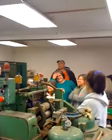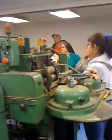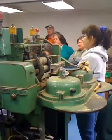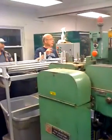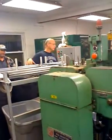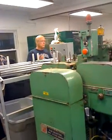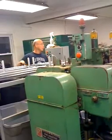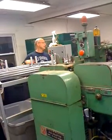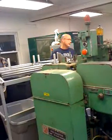Have you done pin drafting or are you ready for today? So if you're going to take multiple rovings, and you're going to take usually all wool, it's a four and four. So you pin draft twice. Four cans in, okay, and then four cans in again. Most of the time when you do an alpaca, it's five in the drawer. In some cases, it's five and five. It's a really fine fiber, something around the 18-micron.